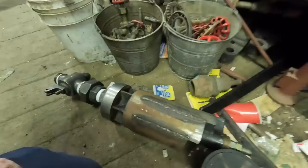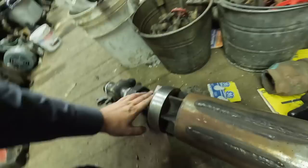So this guy is threaded on both ends, nuts here to hold the bell down, and then it's threaded into the bowl down here. So this bell can actually rotate separately of the bowl if you were to loosen the stud. And typically, a lot of railroads had rules to aim the tallest chime in one particular direction to make sure that it would carry the furthest and give the loudest warning. And that was kind of different per railroad. Lots of little interesting, fun little details.